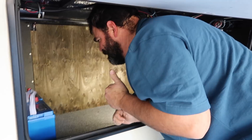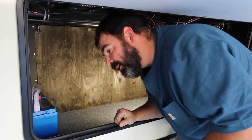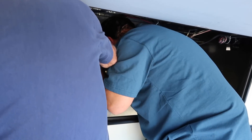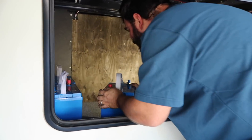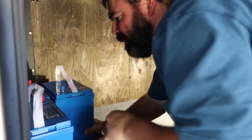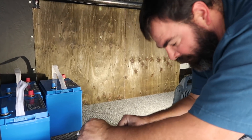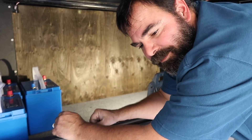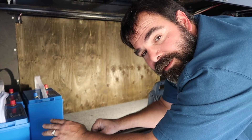These are Full River 6-volt 224 amp-hour AGM batteries. Since we're using AGM batteries, we do not need a venting system for these because they are sealed non-venting batteries.